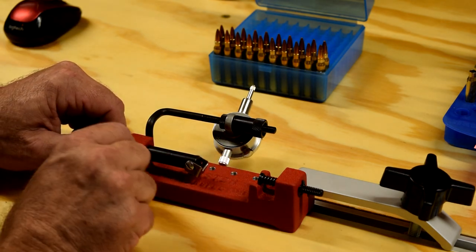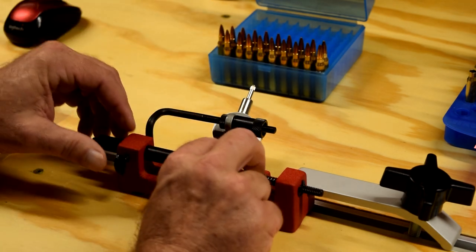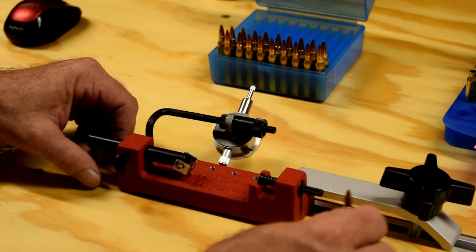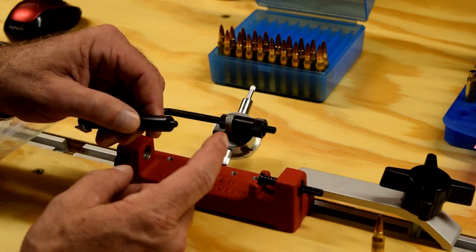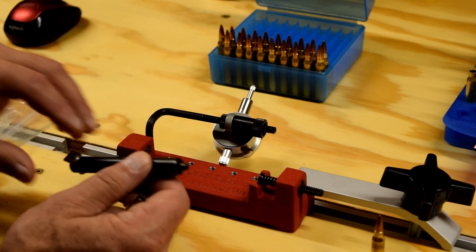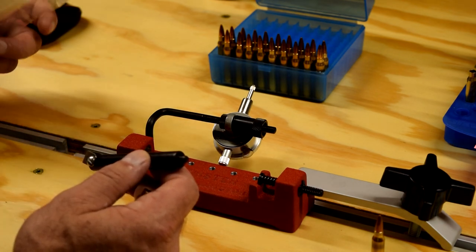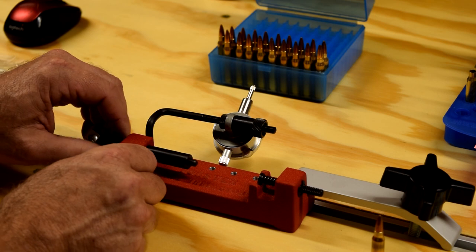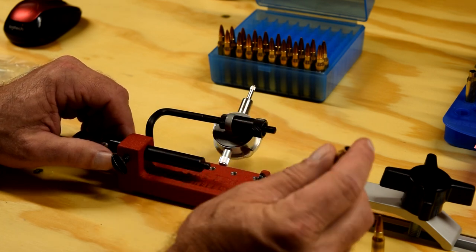On this side you've got what I'm calling the pilot bar — I don't remember what they call it. It's got a v-groove here if you're checking the bullet runout, or you could even put it on the case neck. This pulls out and if you're just going to check the neck or the cartridge itself or the shoulder, there's a pilot. But the pilots are not included with it. This is a pilot for 223. I've got a pilot for 264 for 6.5 Creedmoor and a pilot for 308. That slides in that way, and it's got a little thumb screw you lock it down with.